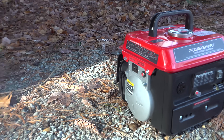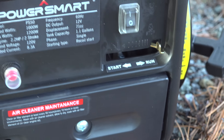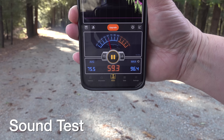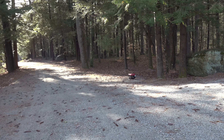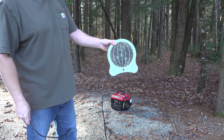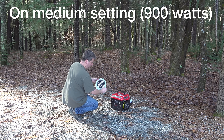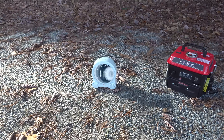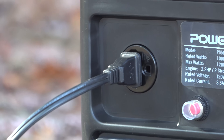Take a look at the amount of smoke pouring out the side, but all the generator needed to do was probably work out some oils, and after about 10 minutes of running the smoke wasn't noticeable at all. That oversized muffler is definitely doing its job. This generator is putting out just under 60 decibels standing 23 feet away. Next I wanted to repeat the same test under load, so I connected a 1200 watt heater. Under load the sound was very different but it wasn't actually much louder — I tested it again and it only reached about 61 decibels.